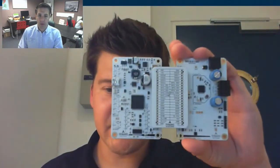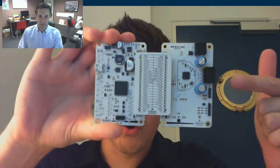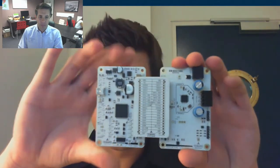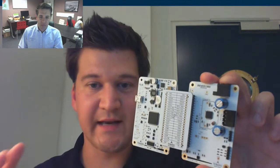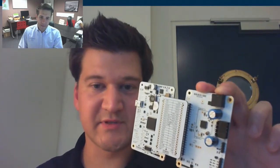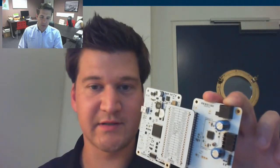So we've done the unboxing — it's modular. There are some precautions we should know about before connecting a stepper motor. First, connect everything together, and then — what you should do — connect the motor before you actually provide the supply voltage. The TMC5130 goes up to 46 volts, so you should be sure that you attach the supply voltage after you connect the motor, or be 100% sure that the driver is not enabled when you connect or disconnect the motor from the module.